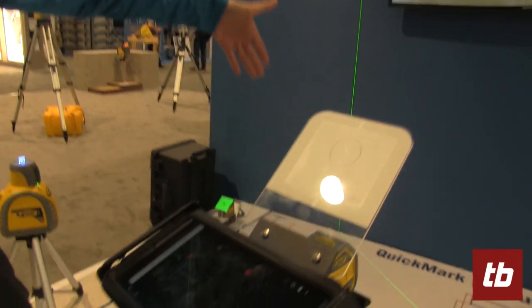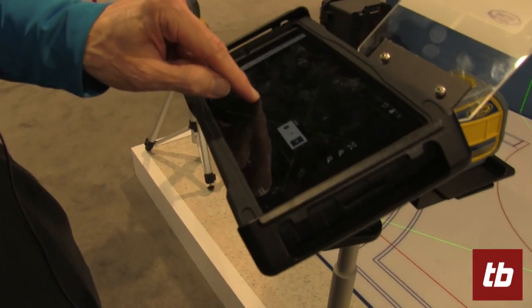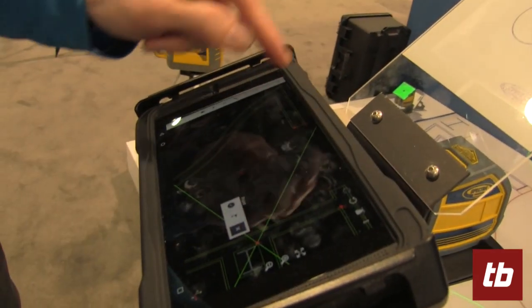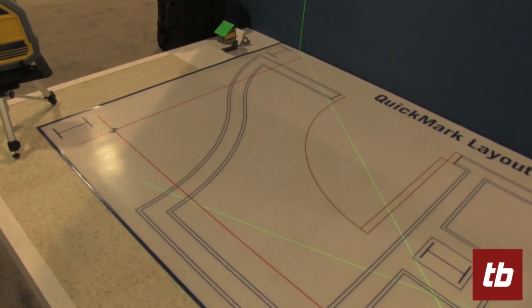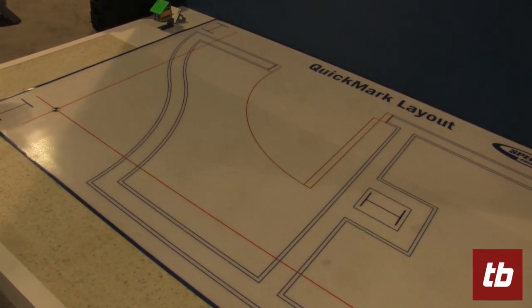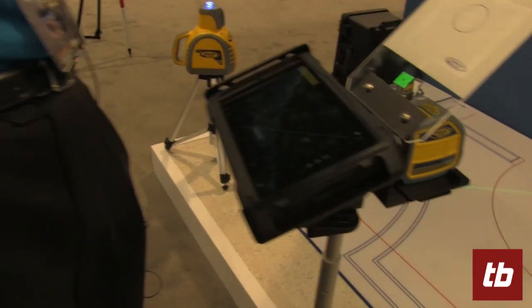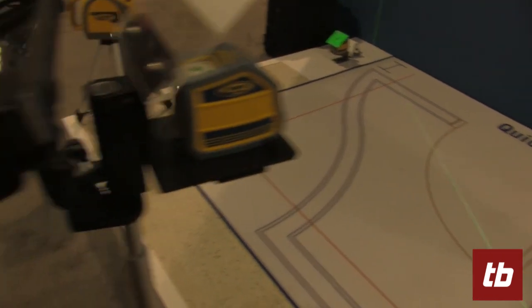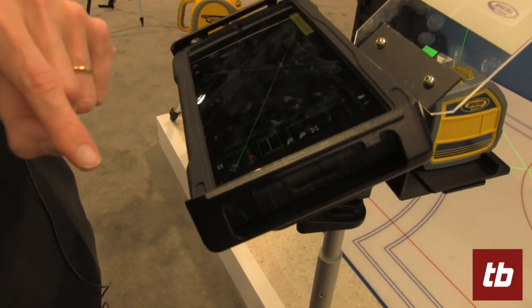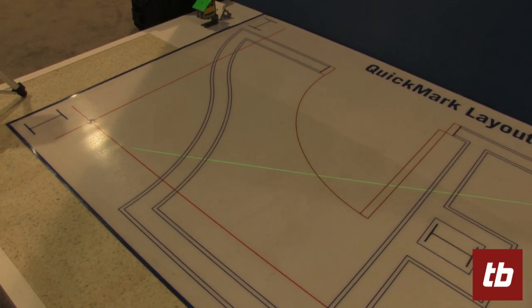Another advantage of this product is handling curve shapes and other complex things that are difficult to lay out. Since all your points are on the tablet, you just need to stake or indicate the point directly, and it will move directly on the curve. I'll select one here on entity — I select one point here, tap here, and my point is directly on the curve. I indicate another point on the tablet, tap my point, and then all the beams move exactly where they should be on the curve.